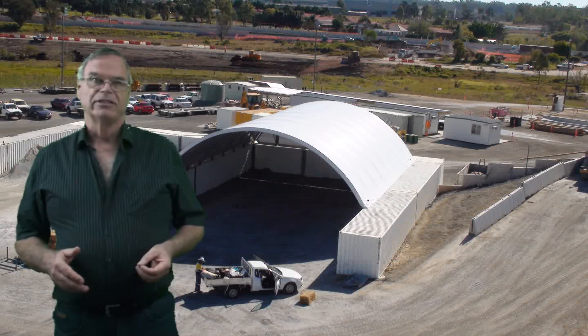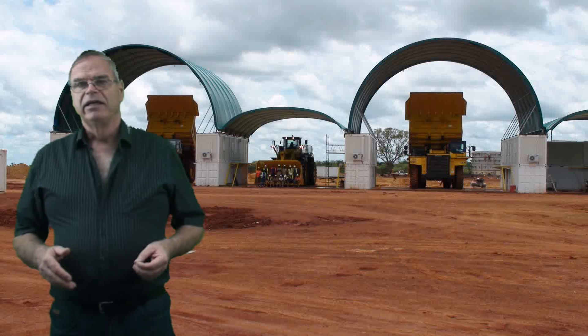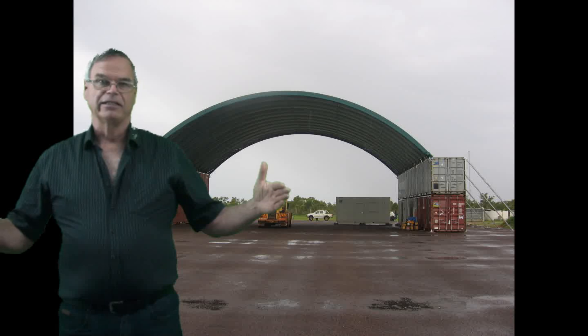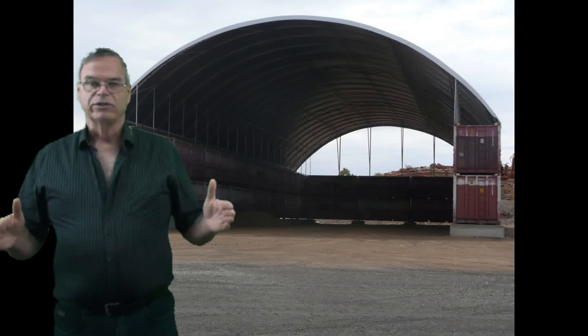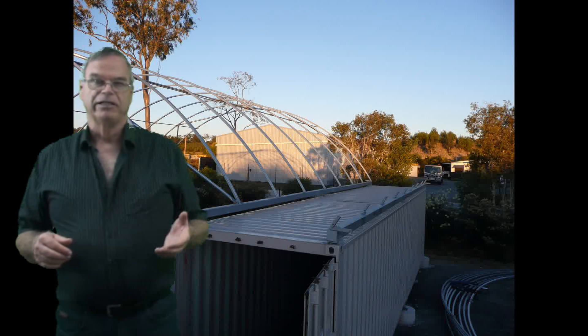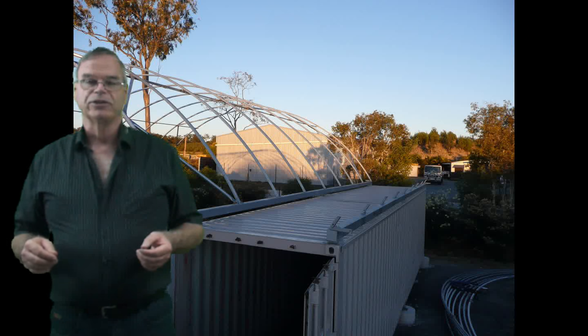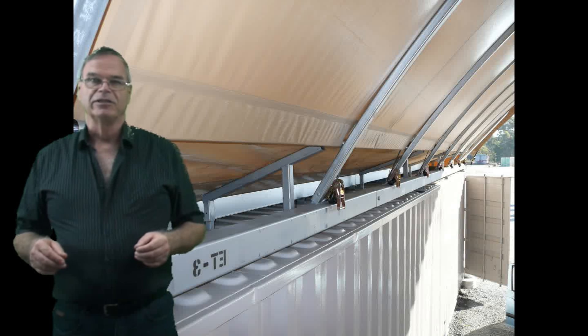You can have them as single stacked, double stacked, or possibly triple stacked, but you need stays when you go up three high because it's a long way up. With the actual structure, you can go internally to the inside, externally to the outside, or internally-externally — whichever works for you. You can weld the brackets directly onto the top of the container, or look at having rails — either weld-on rails or rails with a twist lock which locks straight into the container ports on either end. On a 40-foot container, you will have one weld in the middle just to support it.